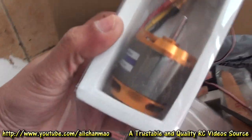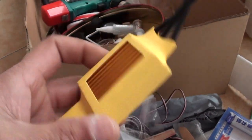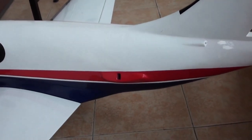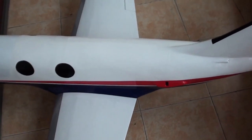When I look at the motors — oh my goodness — they are really, really heavy and big motors. And look at the ESC, it's a 100A ESC, so there will be two of them. I will just mount them outside because I don't want to waste so much cable mounting them inside. Mounting the ESC on the backside with the motor will also keep the plane a bit tail-heavy, because my batteries are really, really heavy in the nose.